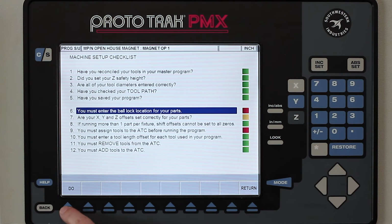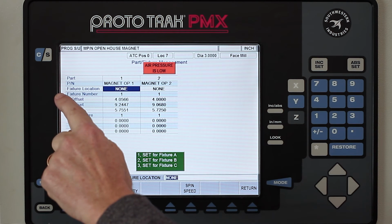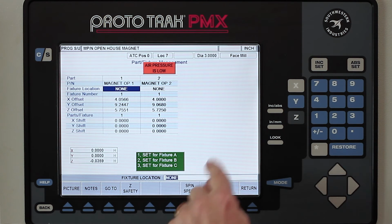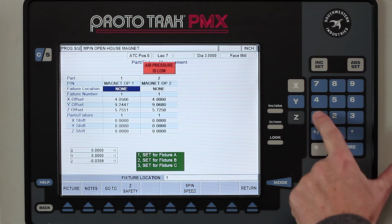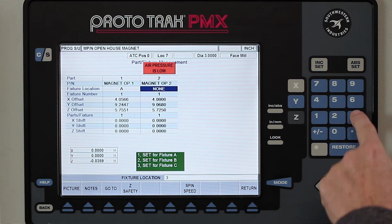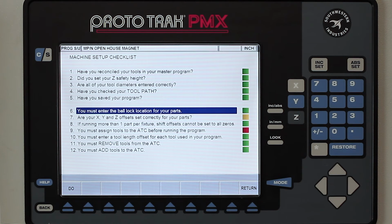So what I'm going to do in here is push do, I'm sorry. And in here, you'll notice right here, it says fixture location, and right now they're not labeled. In the description in the green box, it's telling me 1, 2, or 3 is position A, B, or C. So my first operation is on A, so I'm going to push 1 followed by the set key. And then I'm just going to move over and come up here and push 3 followed by the set key. And when I push return, you'll see that that's now green.